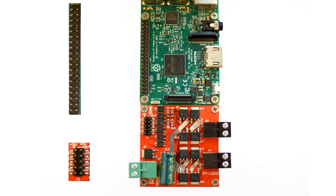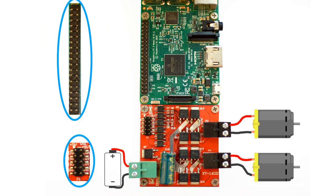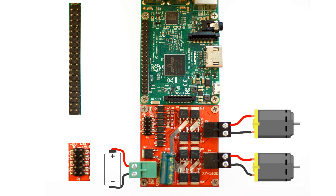I created this diagram to outline the pins on both boards and the way that they're going to interact with each other. We have our two motors with their power and ground going to the headers, and we also have power input from some sort of power source going into the header on the other side. Now our pins need to be connected. We're going to connect the two power pins and then we're going to put in our grounds.